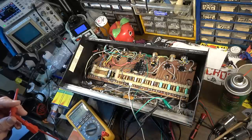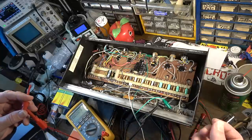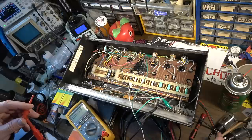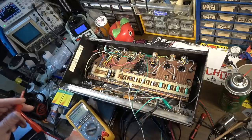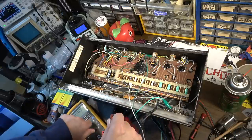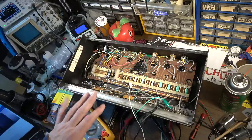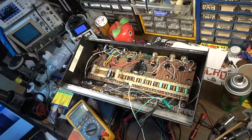Of course, if somebody liked using the amp with overdrive, those would have less headroom and they would overdrive quicker than 6L6 GCs. But if you're using this for bass, you probably don't want that. To each his own, but I don't think you would want that really for bass. I don't know too many people who use these for guitar purposes because they're just not voiced for that.